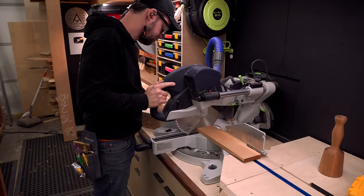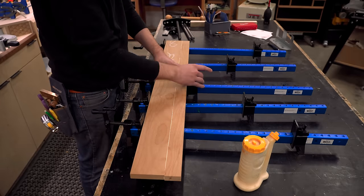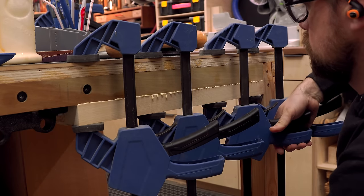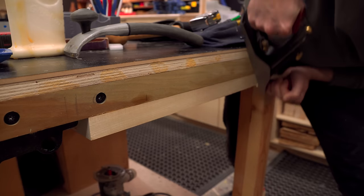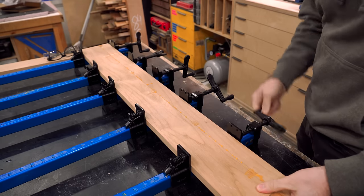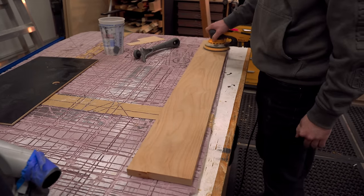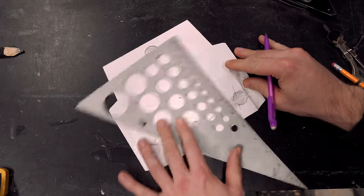The boards I'm going to be wrapping the outside of the workbench with are Alder. I like Alder because it's pretty affordable, it's grown out here in Washington State, and it's a pretty soft wood — which I like for the outside rails on a workbench because personally I would rather dent the side of my workbench than dent a piece of furniture I spent a lot of time on. These are also going to be slightly taller than the original sides, tall enough to cover the hardware for the vise, and a bit more depth gives me more room for T-track. The two sides getting vises need even more depth to account for the screws in the vise, so I glued on a board larger than needed and will cut off the excess later.